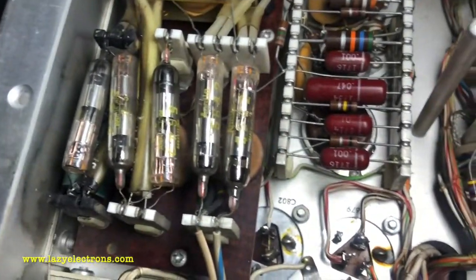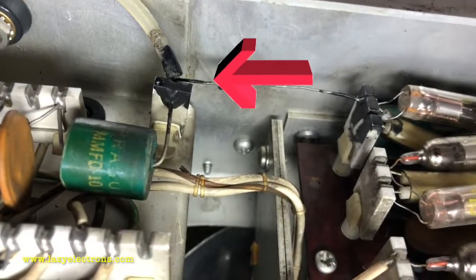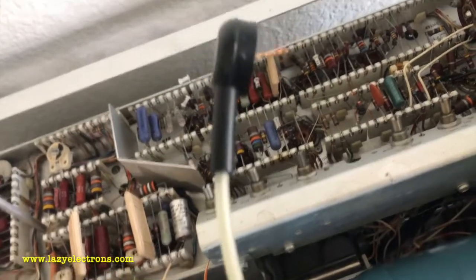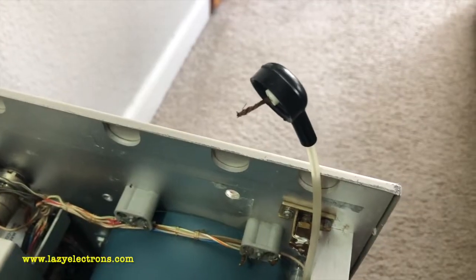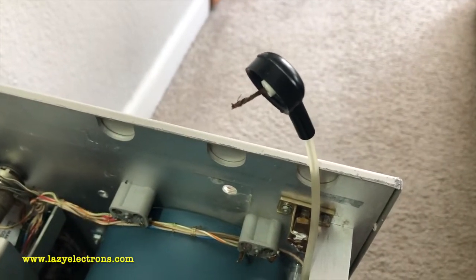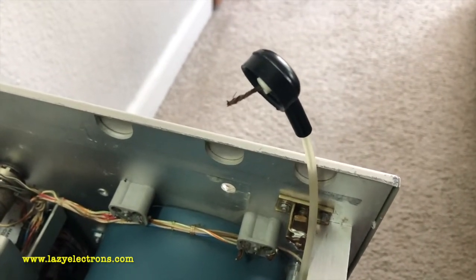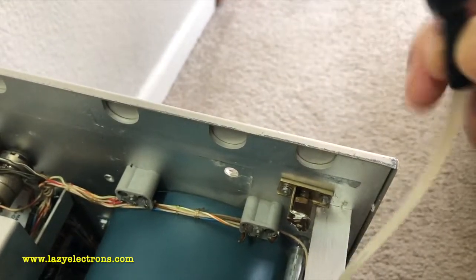It's coming in definitely from this place, from the HV out, which I've cleaned. I've disconnected the CRT HT because of the hissing. Safety warning: if you ever unplug the HT connector and operate the scope, you have to discharge it before you touch it or connect it.